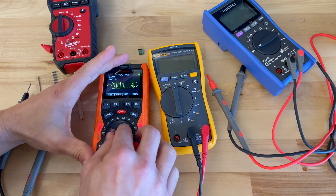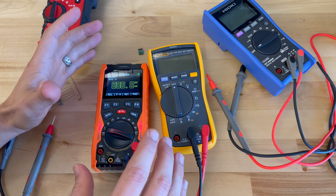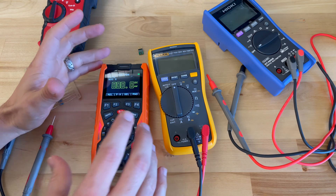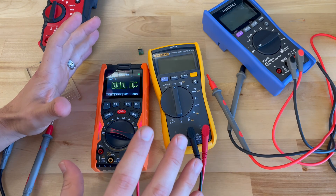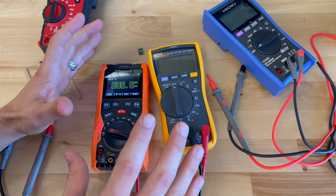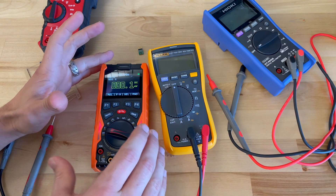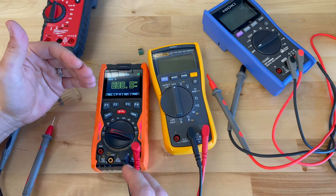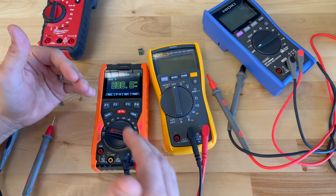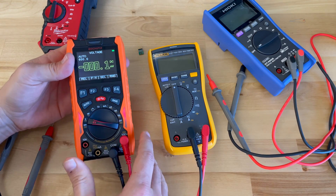I'm not going to use this meter to measure current right now. Anytime you've mixed a current measurement function and an oscilloscope function, I'm already a little bit nervous as far as oscilloscope safety goes. The good thing is this is an isolated scope — a lot of times an oscilloscope is connected to ground, and you've got to worry about making a connection to ground. This one won't have that issue because it's essentially isolated since it's running off battery.